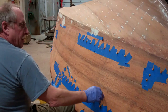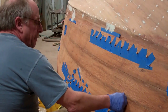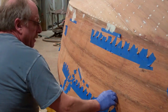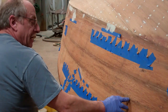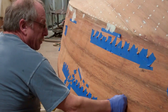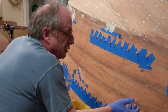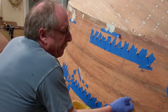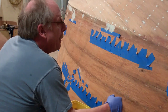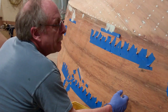Well, when I started sanding, I quickly realized that some of these boards — one side of the seam is proud of the other board on the other side of the seam. I figured out that the fasteners had lost their grip, so they weren't holding the boards very tight. So what I did was I took out the old bungs, refastened the boards, tightened them up a little bit, and taped it off so that the Gorilla Glue wouldn't be all over the side of the boat.